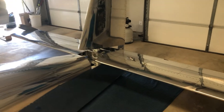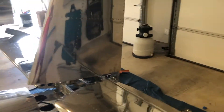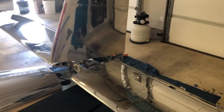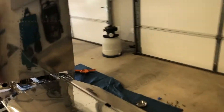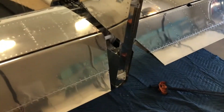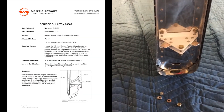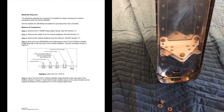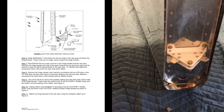We found one little problem with the elevators — I'll film a video on that in a second. I also found there are two service bulletins. I'll show you more in a second, but for right now I'm going to have to replace this rudder stop. There's a service bulletin on that, so I'm going to replace that.